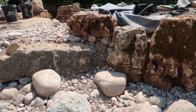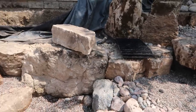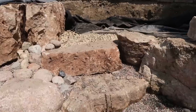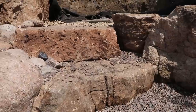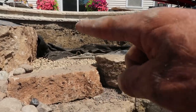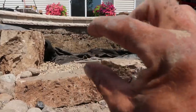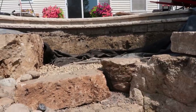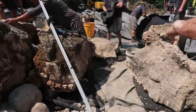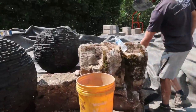Just look at the rock work and some of these massive boulders that are in here. We've got a little fish cave area underneath that flat stone. They also have a little girl, and we wanted to make this thing accessible and approachable, so we went ahead and did some very, very informal steps. You can see these flat slabs of limestone — weathered ledge stone — which really lends itself to this informal staircase kind of look. Right above that will be the three formal steps going back up and tying into this wall, with the liner coming all the way back up against that wall and three courses of steps running along that part of the liner. I just love how this is turning out — these big chunks twisting and turning in and throughout the pond.